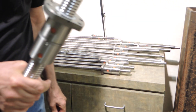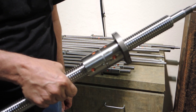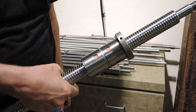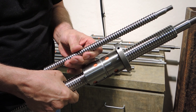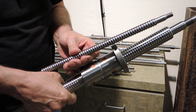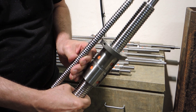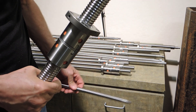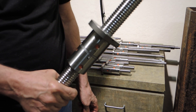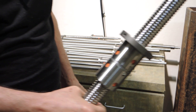This is the 32 millimeter C7 screw for the heavy-duty Z, and just for comparison, this is your 16 millimeter screw for the G704. So you can kind of get an idea just how much bigger it is. It's kind of a monster screw, but it's really nice for people that don't want to use lifting springs on the larger mills. This thing works quite nice.